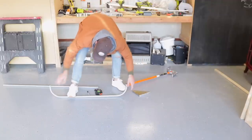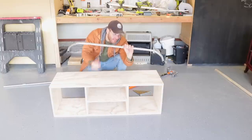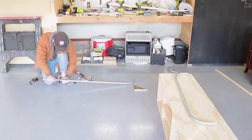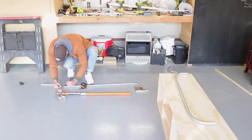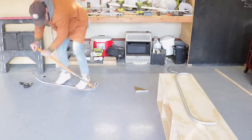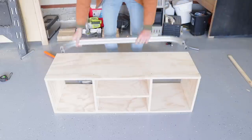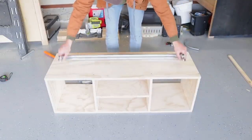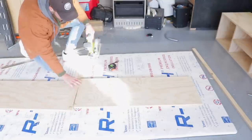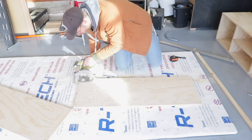Now I'm going to try and duplicate this bend — fingers crossed. One thing to keep track of is where your first bend is: when you bend your second, you want to make sure it's perpendicular to the floor so that each of your bends are square. My two pieces were not identical but they were really close. From there I got my circular saw back out and cut a 44 by 12-inch piece that I'm going to use as the plate for the legs.